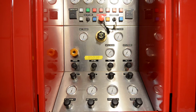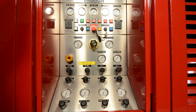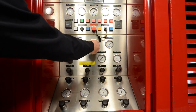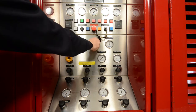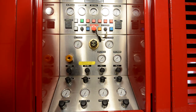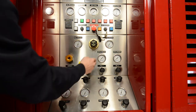This is the method for filling an SCBA cylinder with the onboard filling bank. The first step is to set the regulator pressure. To do so, we need to introduce air into the system from one of the four onboard banks. Simply turn one of the knobs labeled 'from bank' to introduce air, then set your regulator to the desired operating pressure. Most bottles operate at 4,500 PSI, but check your manufacturer's recommended specification. Some modern cylinders have a 5,500 PSI rating, while older cylinders might have a 2,200 PSI rating.